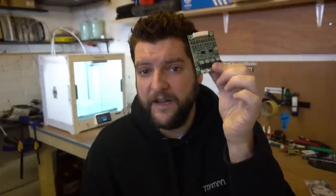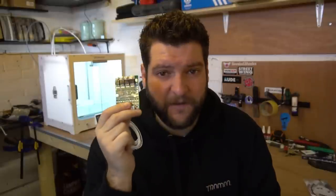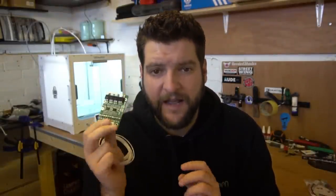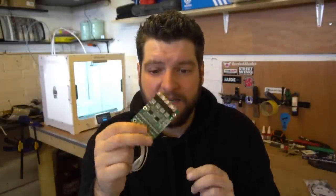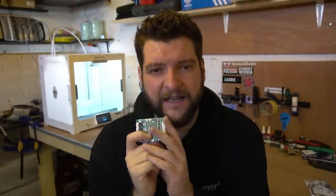For the other electronics you'll need in your build, you definitely need a battery management system, otherwise known as a BMS. This takes the charge voltage and amps and spreads it evenly across the pack to balance-charge all those individual cells, so you definitely need one. It's the safest way to charge an electric skateboard and it keeps your batteries always balanced. Make sure you get a BMS with the right S rating for how many series batteries you've got - we're doing a 10s build so I've got a 10s BMS.